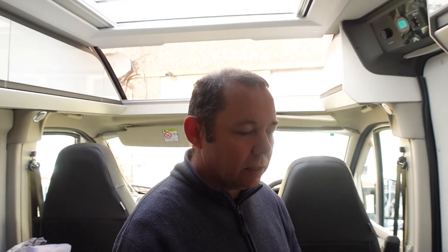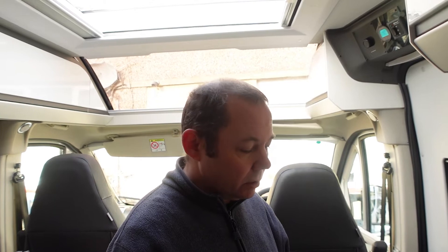This means the gauge becomes useless because it'll always show 100 percent if you've got too much negative. If you've got say 20 amp hours negative because it's gone past the full capacity, you've got to use up that 20 amp hours on the negative side - which won't show on the gauge - before it starts dropping that 100 percent. I'll put a link to someone else's vlog who showed it better. Bear in mind my gauge was a newer one, so they might have changed the algorithms because of that problem.